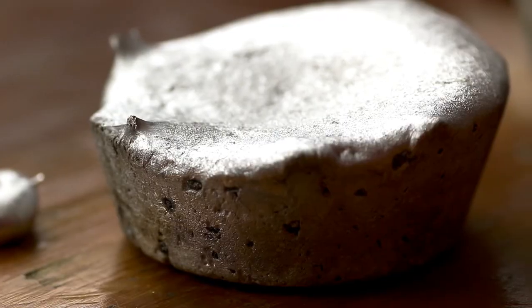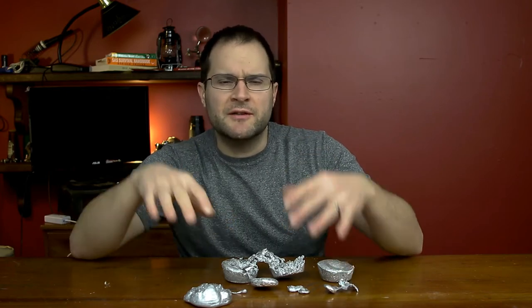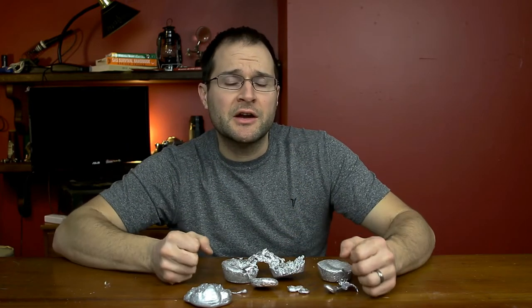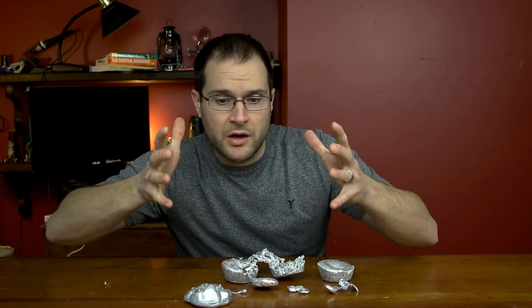So if you have all your aluminum ingots prepared or your soda cans prepared and you know everything's gonna fit in there, this might work. But like I said, it is short-lived because once most of the fuel is burned out of there, you can't really add more, because once you start knocking the sawdust down, it really flames up and it doesn't really burn any hotter. It's like a one-time thing, you're not adding more.